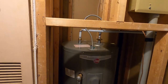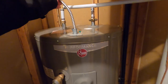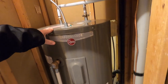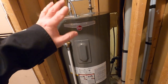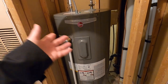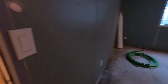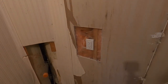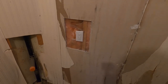Part of the process was we had a gas hot water tank in here, and the electrical inspector wanted us to install a new one so we'd have a complete job. This tank is just kind of temporarily sitting here — we'll be taking it out, cleaning this all up, putting a pan underneath it, and doing new plumbing. It was just mocked up for the sake of the electrical inspection — there's no water in it, not even hooked up. We also had to go through and put covers on all our switches and plugs throughout the whole home — no open boxes. We had to install ground fault receptacles in the bathrooms — before there were just the standard outlets — so that's now up to code.